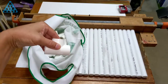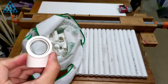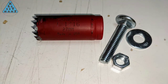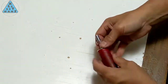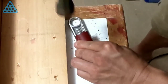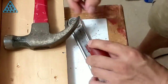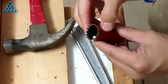To create this sliding rail, I'll need to bore out the inside of the tee to allow the joint to slide across the PVC pipe. What I used to bore out the raised portion inside the tee was this 1 and 1/16 inch hole saw — it's close in diameter to the 3/4 inch PVC pipe that fits the tee. Before I do any boring, I need to modify the blades of the hole saw. Saw blade teeth usually have an alternating pattern from side to side. I want to push in all the outward-leaning teeth to prevent the hole saw from sticking to the plastic as it cuts into the inner sides of the joint.